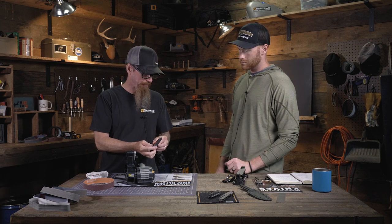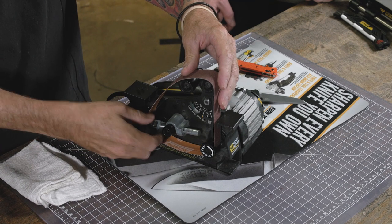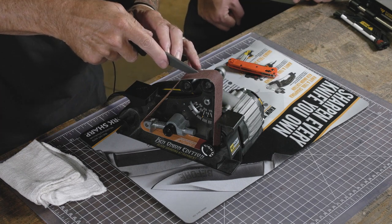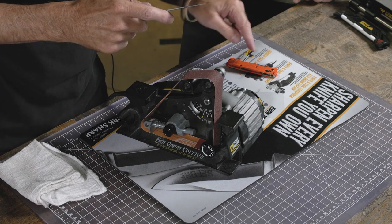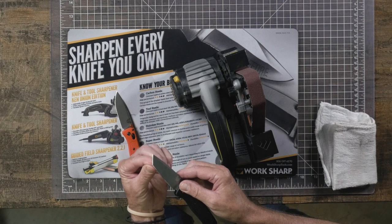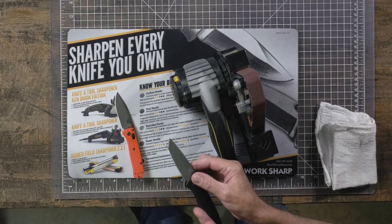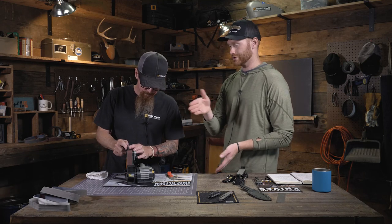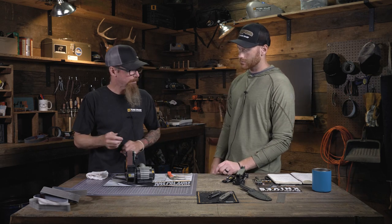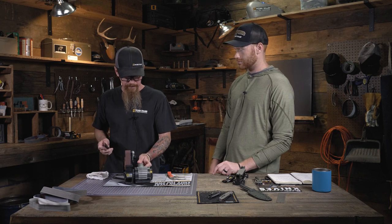Now that we know how we want to shape that and how much material we need to take off, we can get started. Since we do have a decent amount of material to take off, I'm going to start with our coarse belt — 120 grit. Basically, come in here and just start shaping that transition, periodically stopping and checking it against the template. We're just going to put that belly in it — take that transition and start grinding off until I can feather this edge of the knife into the tanto. We'll take that edge totally off and then go back and set the edge again, coming back in to resharpen until we get a nice consistent bevel all the way across. We have a rag soaked in water to help keep it clean and make sure we don't overheat.